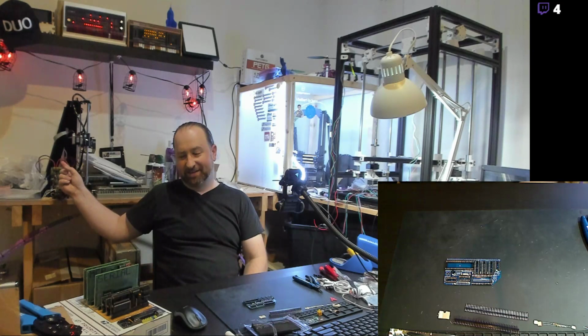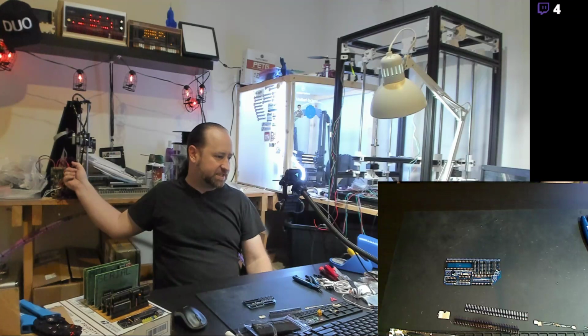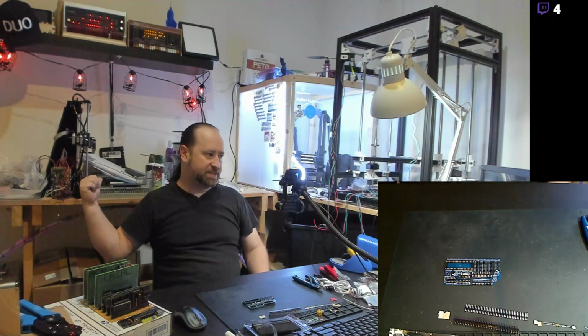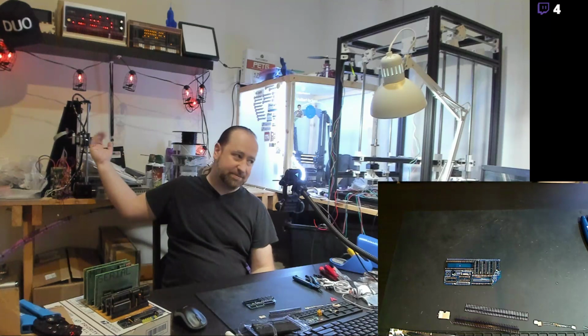This driver board here actually has TMC2130 drivers on it, which are the nice ones, and they're actually hooked up with a harness using the SPI control, so they're full on digital control, and I use that as a test bed for the configuring of it. So it doesn't print, it just moves. If I can get it to make this thing move, then I'll throw it into other things.